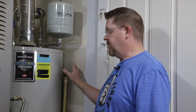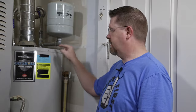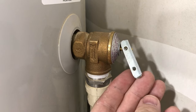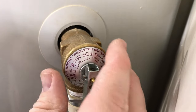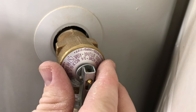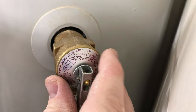The first thing to do is locate your T&P valve. Generally they're going to be located on the side of your heater near the top, though I've seen a couple on the tops of heaters as well — that'll vary depending on the manufacturer and model. You'll know it's the T&P valve because it has a little handle on the outside that generally flops around and is loose until you actually pull it. It will have a little ring on there with a bunch of text printed on it indicating the exact specifications of the valve, so when you're shopping for a replacement you'll know exactly what to buy.